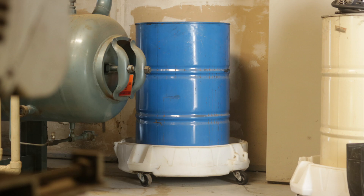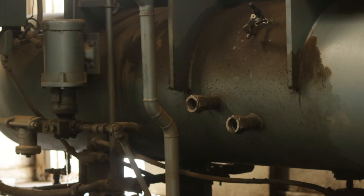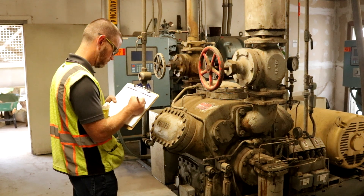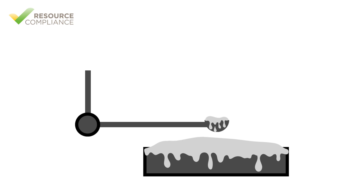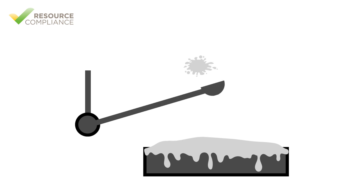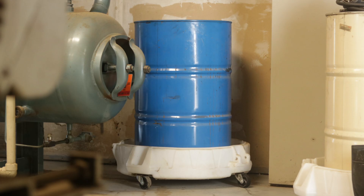Because of their rotating components, all compressors require lubrication. Early designs of reciprocating compressors utilized a splash system in which the throw on the crankshaft would dip into an oil pool in the crankcase and splash it over the moving parts as the shaft rotated. Today, reciprocating compressors used in industrial refrigeration utilize internal force-feed lubrication.